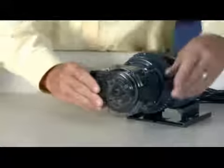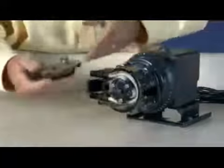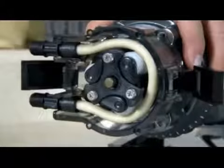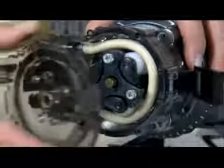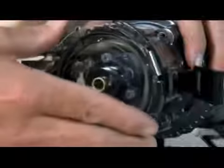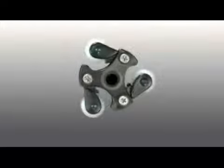Remove the tube housing cover and flip to use as a tool to expand the roller assembly. Align the center of the inverted cover with the center of the roller assembly, so that the 3 holes on the face of the cover align with the 3 knurled lugs on the roller assembly. Position the cover feet near the bottom. The roller assembly needs to be expanded so the tube is pressed against the tube housing wall.